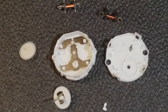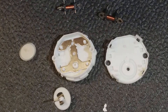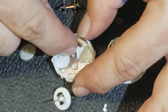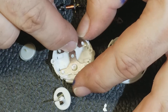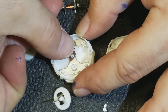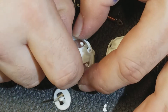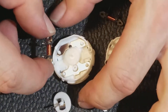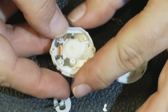So anyway, if you ever need to get out of a jam without buying a new one, I would suggest taking it apart and just cleaning the holy heck out of everything. Get some rubbing alcohol or something like that to clean out any crud or dried-out lubricant. Sometimes they lubricate these and the lubricant goes bad from sitting — dries out and becomes more like a glue. And these guys drop in. There's no screws holding this — it's just all snapped together and pressure fit.